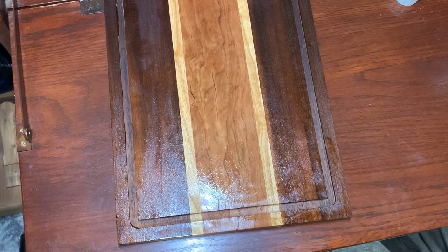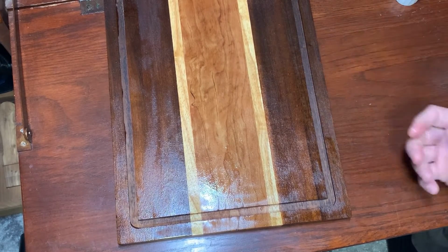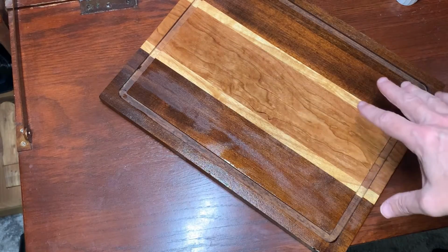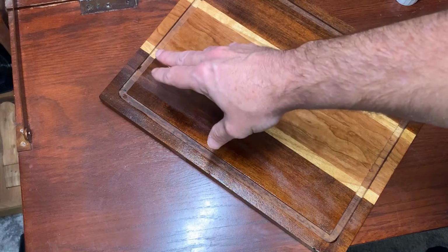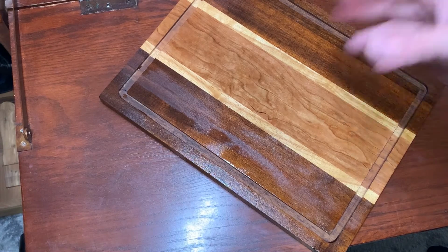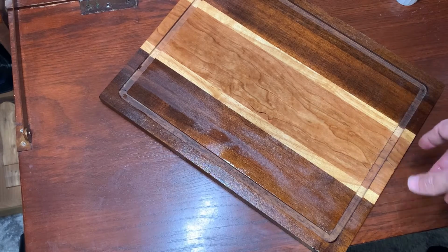Okay, for the next 20-30 minutes, this is all I'm gonna do. I'm gonna let it rest, and not rest, but like absorb. And you'll see that there are some spots that are gonna start becoming dry. And you just spread the oil from the areas that are more wet into the areas that are soaking it in until there is no area that's really soaking it in. That's how you know that you're done. And then you just wipe off the excess. So I'm gonna come back when we're ready to wipe off the excess.